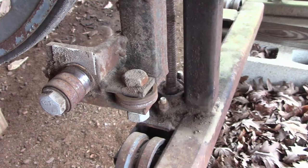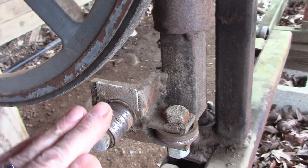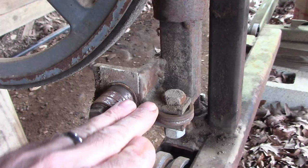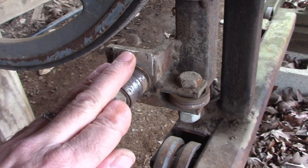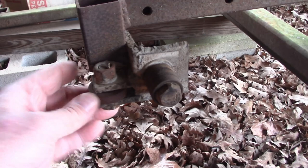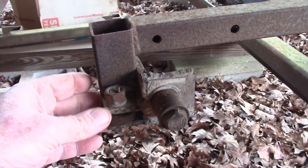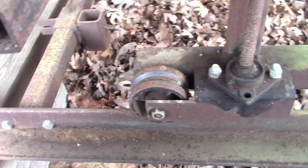This keeps the blade from riding up, and this keeps it from pushing back. I've got some shims in the back and that's how I level it — you want your blade parallel to your cut. If it's tipped up a little bit, it'll wave because it'll ride up until tension catches it and then turn down, just waving back and forth. Over on the other side it's exactly the same, just adjustable. You can slide this guide in and out — like any bandsaw you want the guide as narrow as possible so the blade is in the cut for a more accurate result.